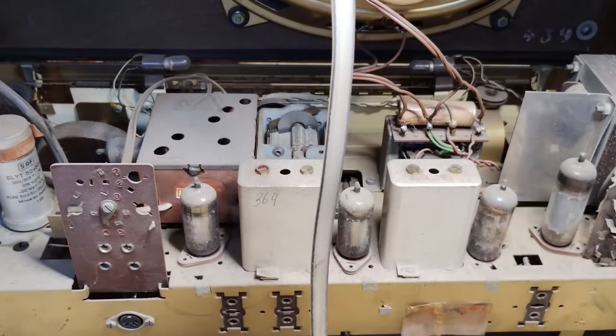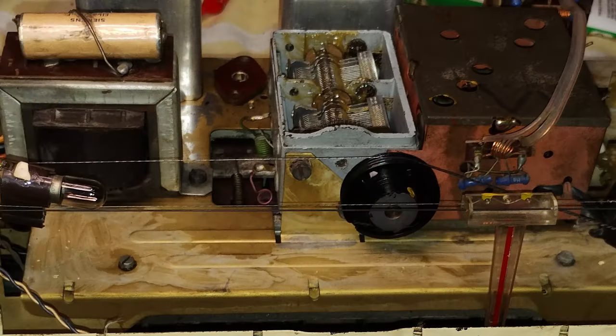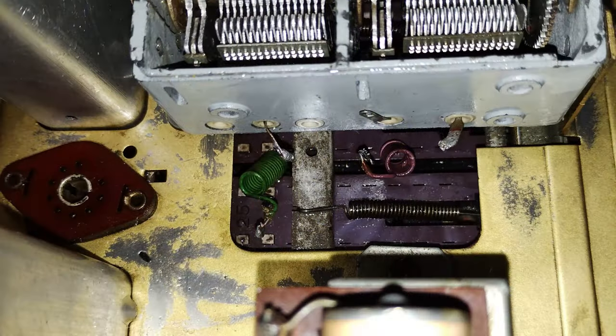The chassis of the radio was painted with a goldish color that can come off by just cleaning the chassis, even using very mild detergents. Therefore, considering that the chassis of this unit had no sign of rust, probably this goldish paint did not have the function of protecting against it. Under this goldish color appeared a shiny mirror surface that resembles aluminum or tin, on which one could easily solder.